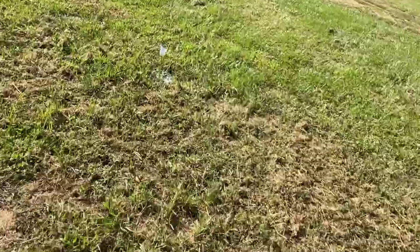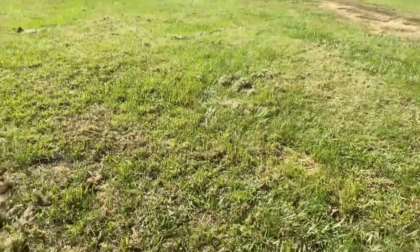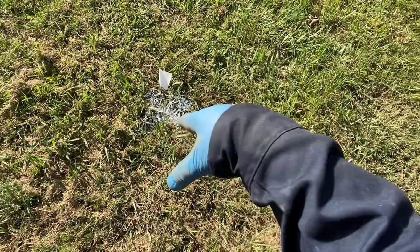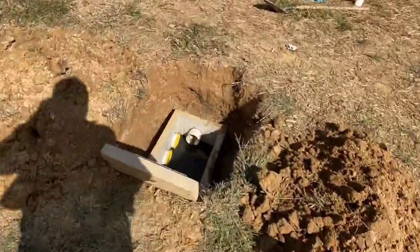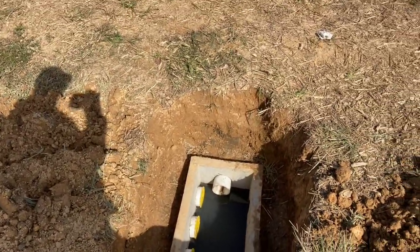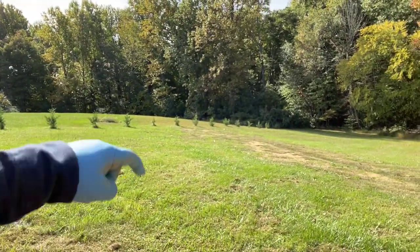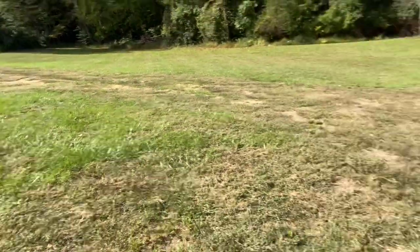And collapsed right here — I can't go any further. I'm supposed to continue another 30 to 40 feet, but it's collapsed. Line two exits — comes out as PVC, and then goes all the way down to the end. I'm actually able to make it to the end on that line. A little bit dirty, but no issues whatsoever. It's actually the best line in the system.